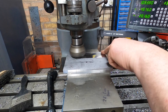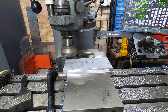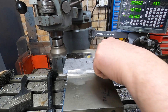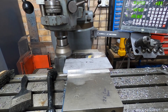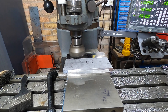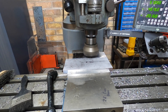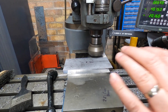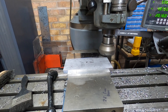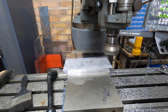I think we're going to need another cut on that — it's a bit off. Still you can see a little bit of pitting. I don't want to take too much off the thickness because these are only 10mm and I think the casting is supposed to be 10mm, so we'll take a little bit more off.